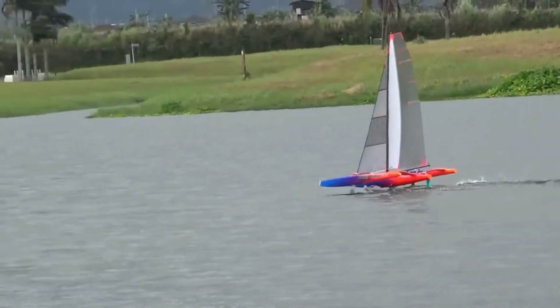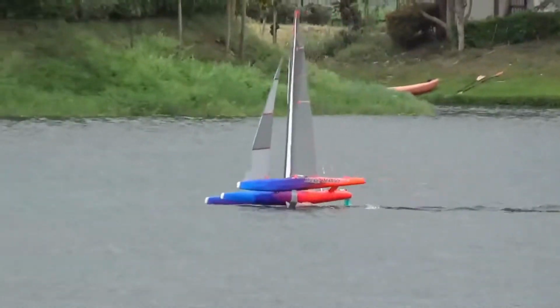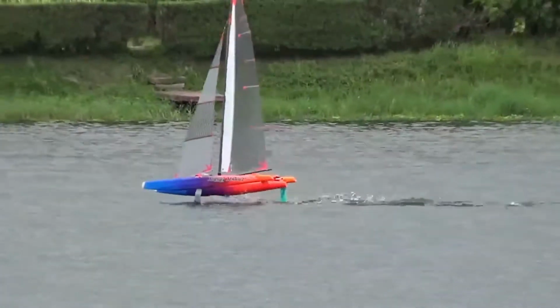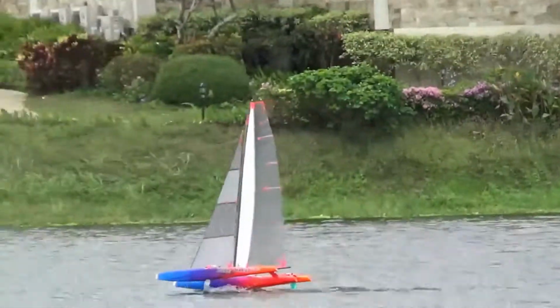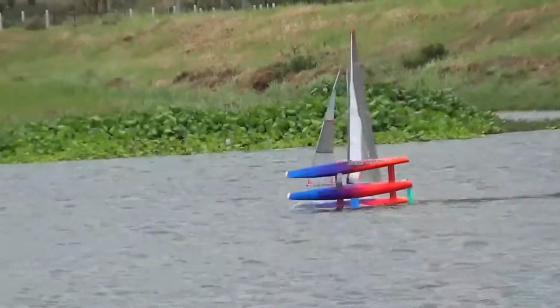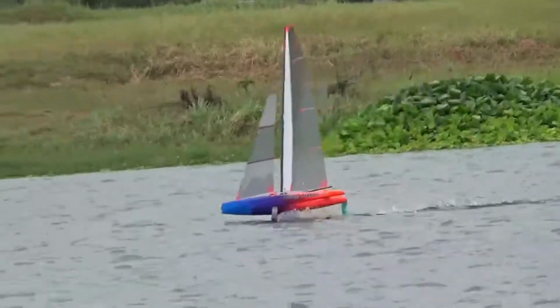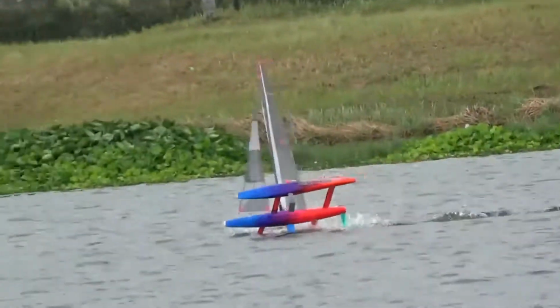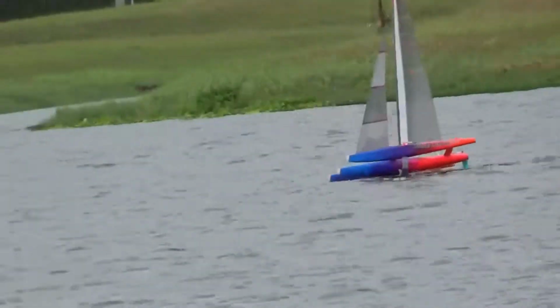Discussions with others over the past week have made me want to check again whether fitting the centreboard to combat the lateral forces unloads the foils to give more lift with less frequent fall downs caused by ventilation on the foils. The boat certainly tracks better and appears smoother through the water, but now I have too much lateral resistance and the boat is heeling considerably more. It is also a lot slower at displacement speeds, as you'd expect with an extra appendage in the water.